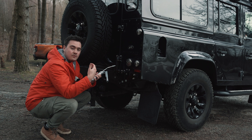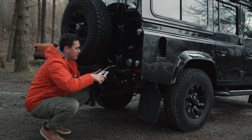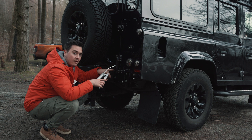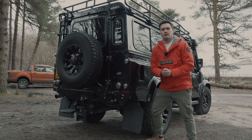I'll just squeeze gently and pump the grease into the chamber, keeping an eye out for any grease coming out. About 80 grams of grease should be enough to fill the chamber — you should also feel resistance, and at that point stop and check you're not getting any grease coming out of the bearing housing. And there we have it — it's as easy as that to service your carrier and ensure it's running as smoothly and optimally as possible.